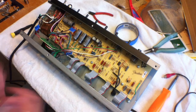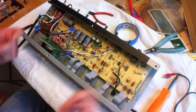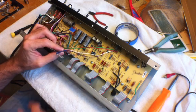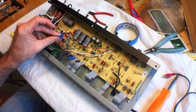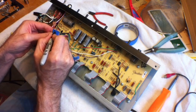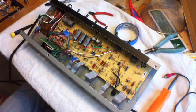Alright, I've got the amp out of the cabinet. Here's the chassis. Before I pull the circuit board down, I wanted to let you know that I'm labeling the push-ons — like this one goes right here, so I labeled it accordingly, and this one plugs into P14. I do not want to forget where these go, because I will. I'm not a qualified amp tech, so I'm not just going to intuitively know where all this shit goes. I do this because I don't want to pay somebody else to do it.